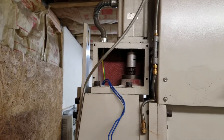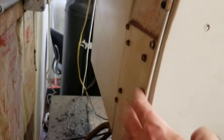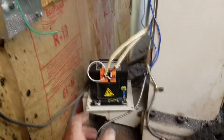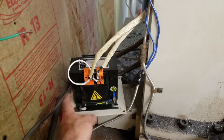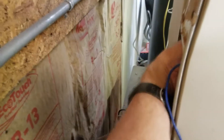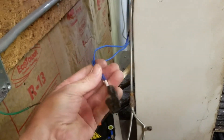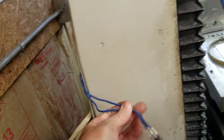I've got the wires fished down there. The next step is to remove this cover plate in the back so you can pull the wires down through. There's a transformer mounted to this cover. I've got the transformer removed along with the cover, and I reached up inside through here and grabbed the blue wires and pulled them out. It says to feed these wires through into the control box and hook them up.